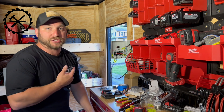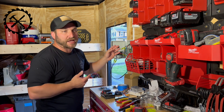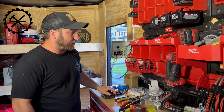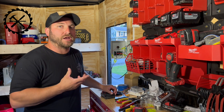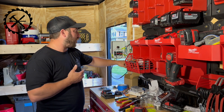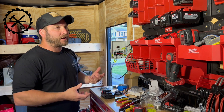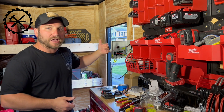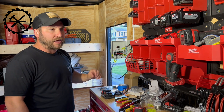I also put a toggle switch in. One thing I didn't realize is that with the low voltage disconnect, it draws power all the time, apparently. And even if it shuts off, I think it still draws some. So what I did was straight out of my battery saddle adapter, my positive line I ran right to a toggle so that I could leave a battery in there. I made it so that the toggle switch is on the side, and then I just hit the toggle switch on, send the battery to the system, and then I can turn the switch on.